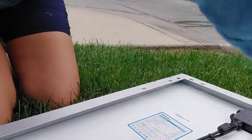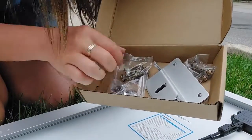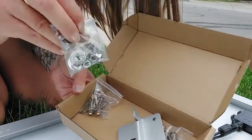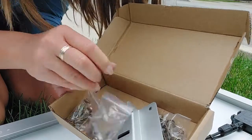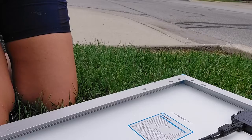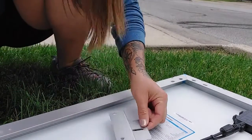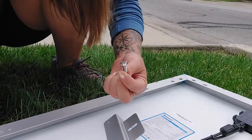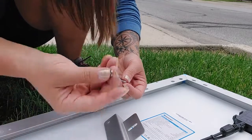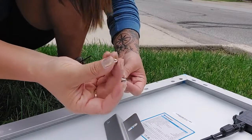So you are going to get a kit that looks very much like this. This will have your Z brackets and your mounts for actually mounting it to the van. This is for the brackets to the solar panel. So I have mine opened over here and I'm just going to show you this and talk you through. You are going to have this Z bracket, the bolts supplied, a flat washer, a spring washer, and the nut for the bolt.